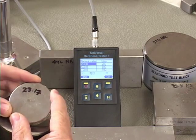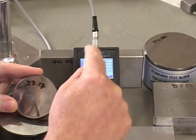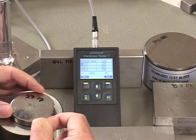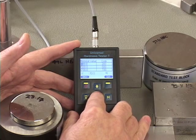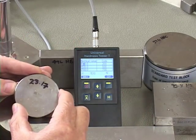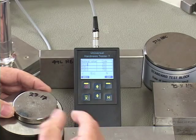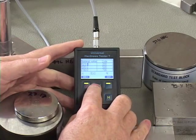To set this up we'll start with the softest test block first. It doesn't really make a difference as long as you go from hardest to softest or vice versa. We hit the edit key and scroll down to edit. The black background changes to dark blue and the value is now editable. Using the cursor control keys I change the value to 0, hit edit, and it jumps to the next field. The block is 23.17 so I enter 2, hit edit, then 3. We only have one decimal place, so we enter 0.2 to round it up.